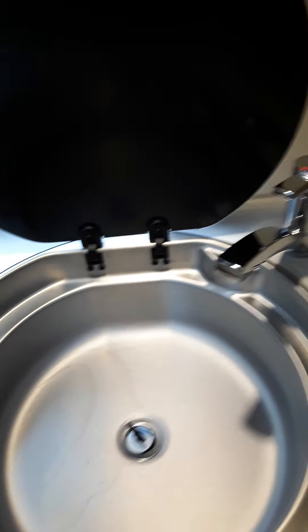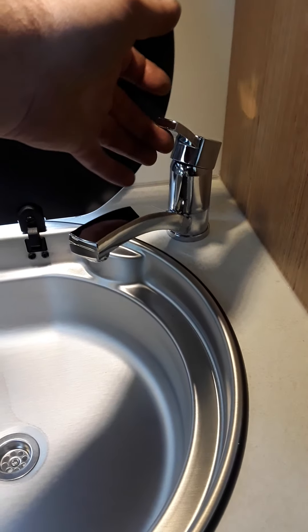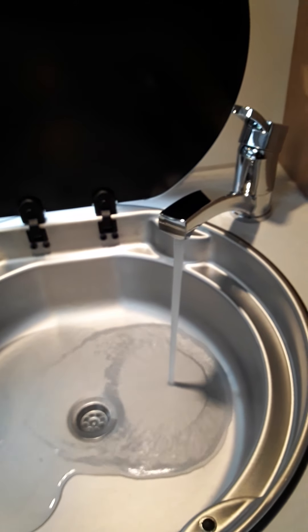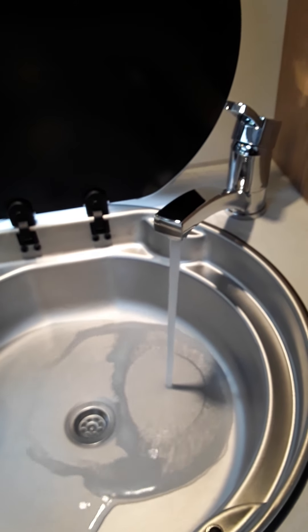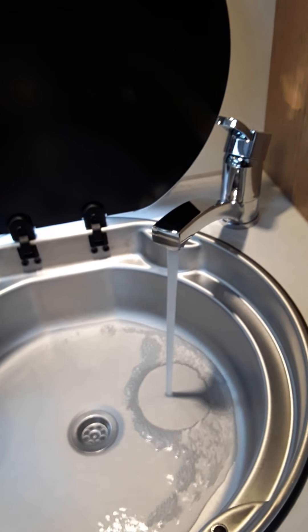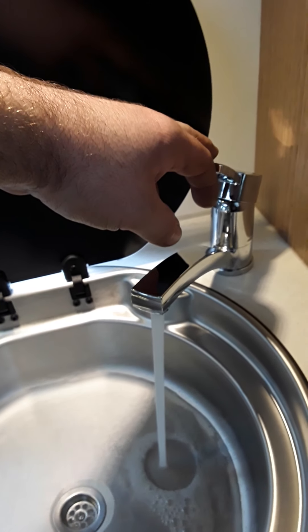Once you fill up, there will be air in the system, so simply run your taps. As you can see, you can hear the pump running — it will take a few minutes for the water to come through. Once it pushes right through, hold it into the middle position and that pushes air out to the two pipes, hot down one and cold down the other.